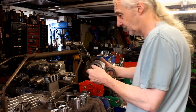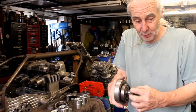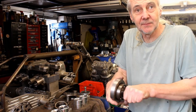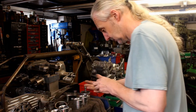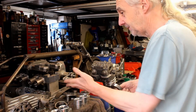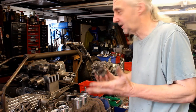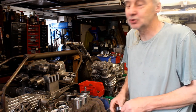So when the crank's in, one of the bearings is partly over that, and the sprocket comes slightly out. So it's literally held, it can't move too much, or flex under the awesome power of your engine, hopefully. Some people say, why don't you leave it standard? Because you know damn well, if you try and put about 85% nitromethane in there, something's going to give.